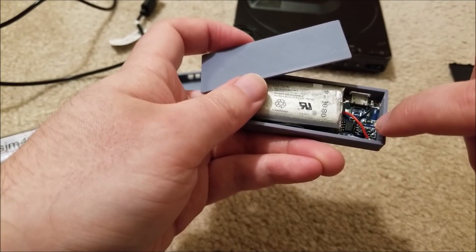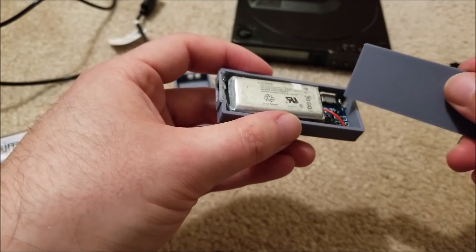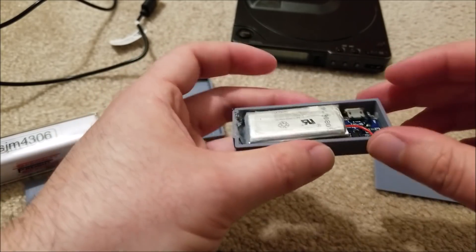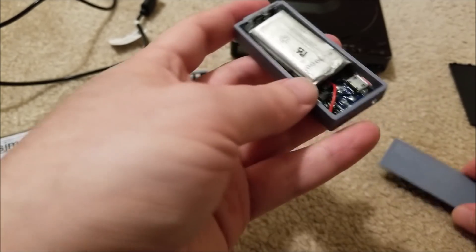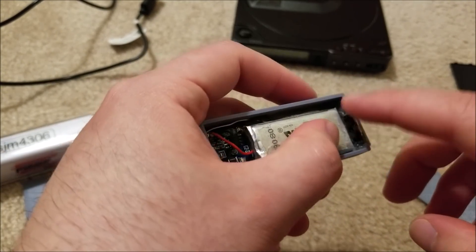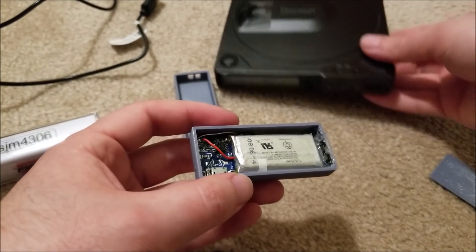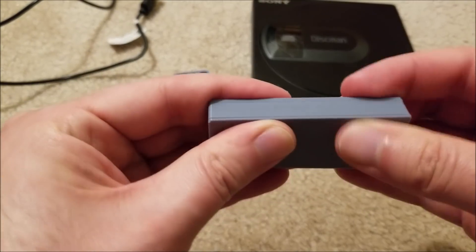That way the LEDs wouldn't need to be rewired, since rewiring these tiny LEDs with 30-gauge magnet wire would be very tedious for any production run. If I were selling these, I'd just put a hole in the top case and use clear filament pointing straight down to the LEDs in the corner. For this prototype though, good enough. I hot-glued the small board in, omitted the diode since I'll only ever use this when not plugged into the wall, and everything looks good.